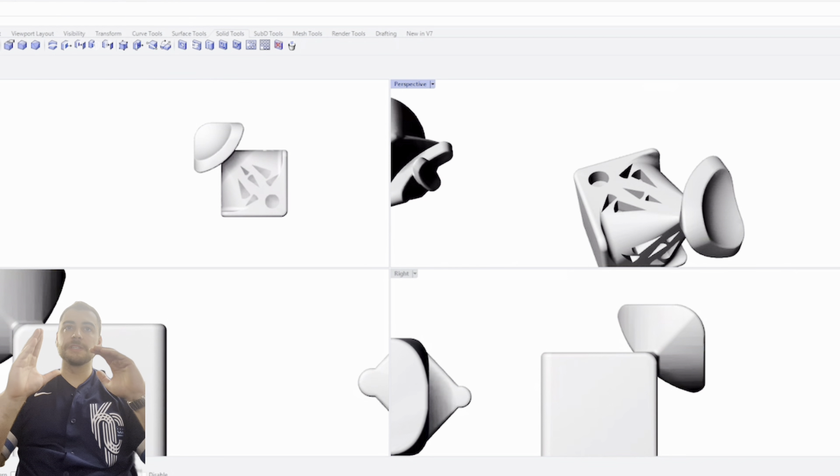There are pieces where these corners kind of shoot over the edge, so we'll definitely want support material — enable support here, and Tree Auto, I found that works best for this. Go ahead and slice the plate. This is showing us exactly how the pieces will be printed — we can see all of those tree supports holding up the areas that need it, meaning the inside of these cuts we made will also need support. It's going to be a pain to take apart. On the inside we have these really cool hexagons, which are going to make the piece very hollow — making it a little bit lighter.